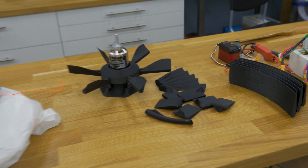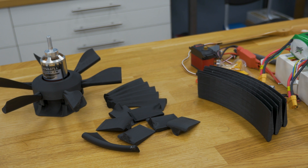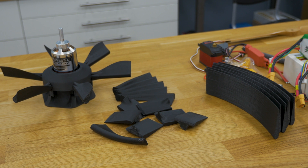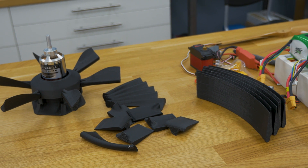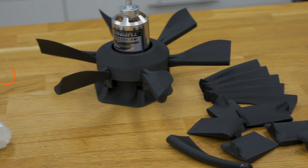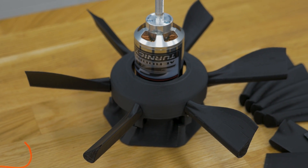On to some parts I already made — I had the printer running almost the entire past week making individual parts for the paramotor. In this case, the propeller cage: because there are a lot of wires and bridles, it's really important to keep them separated from the propeller. We don't want a mess of wires wrapped around or cut by the propeller. The cage should help with that, and there are also some design aspects of the cage I'm going to test.